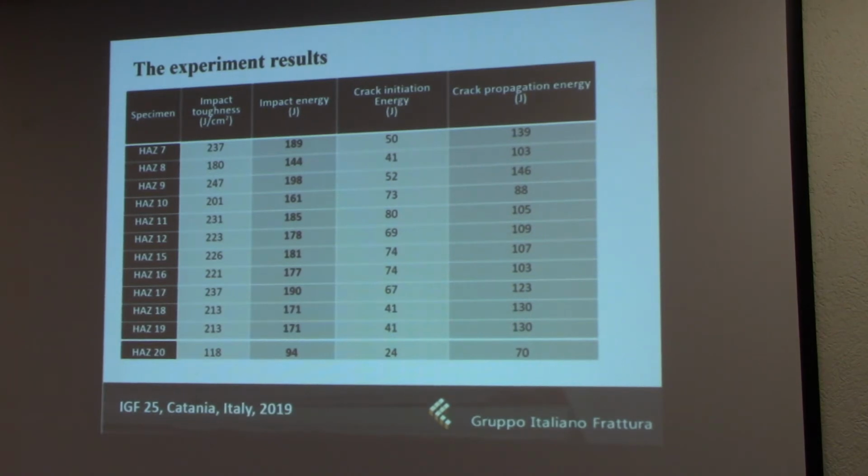During fatigue, the crack at one point simply stopped propagating, and when we broke it later for photography, it broke in a very strange way. It just split horizontally, if I can explain that, similar to what happens when you have manganese sulfide inclusions in metals similar to this one, although I'm still not sure that was the problem in this case. But those two specimens were very close to one another in terms of location, and they both gave us much different results, so maybe that's an interesting topic on its own.